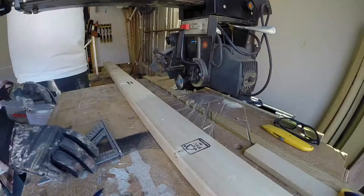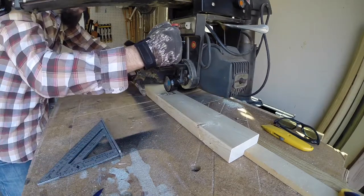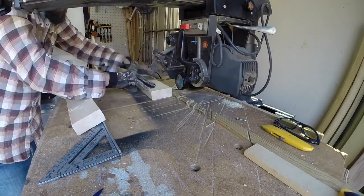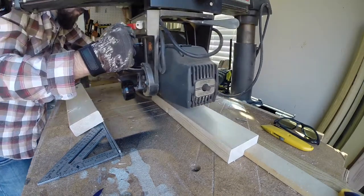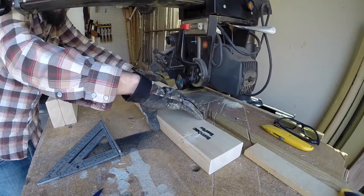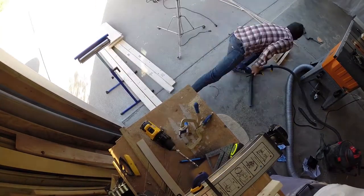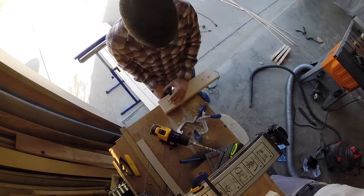In this video, we're going to build a bed with storage. To get this thing started, I made a list of all of my cuts. The bed is essentially two boxes with 2x4 pieces joining them together in the middle. Two box pieces will sit on a 2x4 frame to elevate it for easier drawer clearance. I was going to use pocket screws to hold everything together, so I went ahead and drilled out all of the pocket holes now.